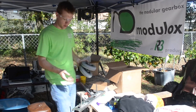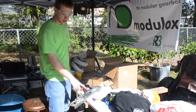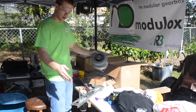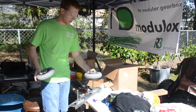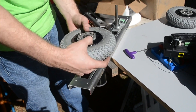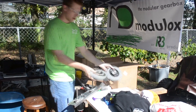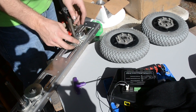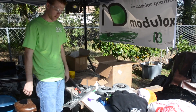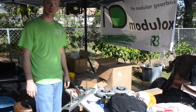Our final shooter for our robot — in three days. Again, we're using the Modulox channel. We've cut it down to two slots to take up a little bit less space, but we still wanted to have that adjustability with the wheels to be able to slide them back and forth to get that final tuning. We're still going to gear up the motors to try to get the wheels spinning as fast as possible, but we may play with the gear ratios as we go along.